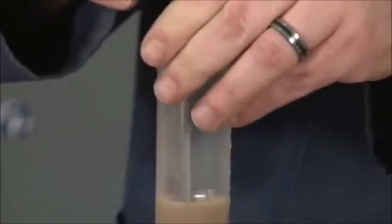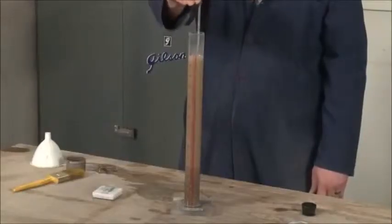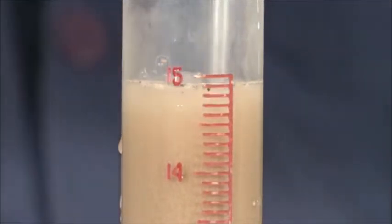When the solution level begins to approach 15 inches, raise the irrigator while maintaining flow and keep the level just below the 15-inch mark until just before the irrigator is withdrawn from the solution. At this point, regulate the flow until the bottom of the meniscus is between the 14.9 and 15.0 inch marks and immediately start the timer for the sedimentation period. If the irrigation is insufficient, fines will still be present in the material at the bottom of the cylinder. When properly performed, virtually all clay particles will be suspended after irrigation.